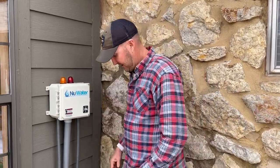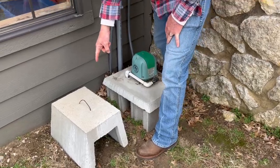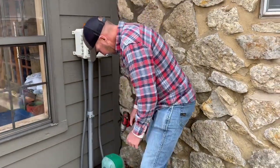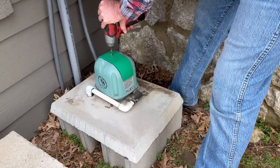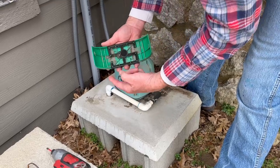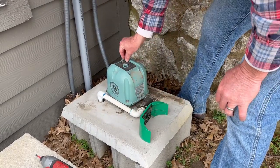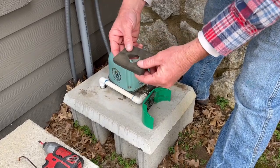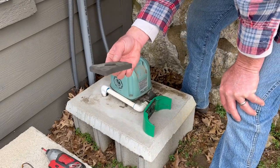Let's pull this off — by the way, these concrete lids are very heavy. There's a screw right on top of this aeration unit. You can pull that off and you can see mine is dirty right now — I need to take this inside and clean it out. There's a little filter on the top right here. You can take this inside and just gently rinse it out with water to get it all clean.